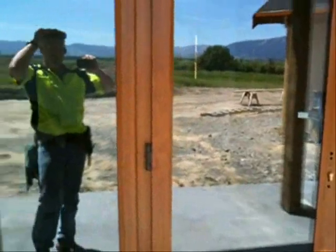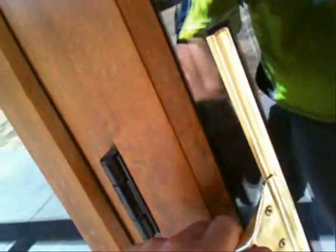When you're doing new window cleans, you've also got the issue of sticky tape, stickers, building debris, plaster, glues, and resins. That is why the triple zero zero grade steel wool will actually take all that out for you. You can see we've got rid of all the cement on the outside. The inside's still to be done, so the tape and so forth is on the inside. These marks you need to rub out — just spot clean them with steel wool as you go around the window once you've bladed it. See the sticky resin down the side there? Just give it a bit of a rub and with your window blade that'll come out quite easily.